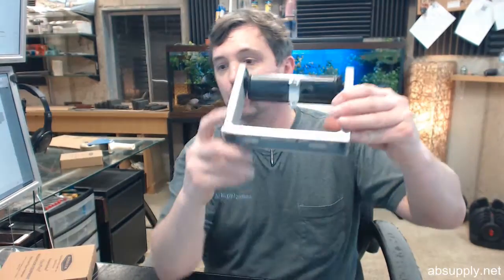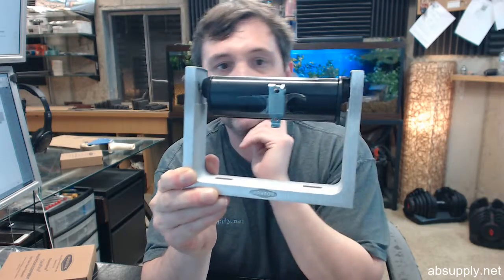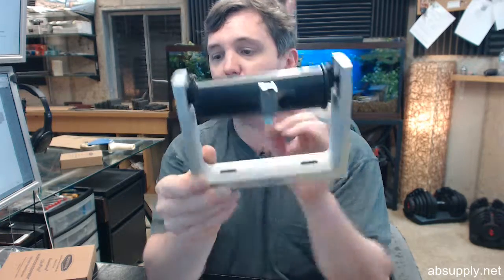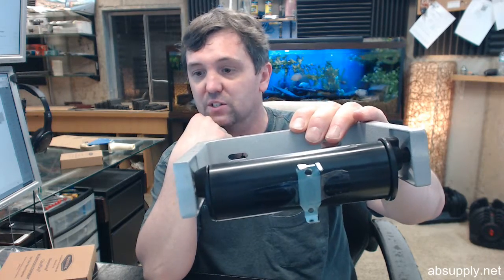Now, importantly, next, dimensional information. Recommended mounting height for universal barrier-free design, ADA compliance, 19 3/4 from the finished floor to the top of the unit. That's important to know. If it's not handicap compliant, you can certainly put it wherever suits your application. Heavy-duty cast aluminum with a satin finish, molded high-impact ABS plastic equipped with retractable pin and concealed locking mechanism with the key. Operation accommodates one standard core toilet tissue roll up to 6-inch. Spindle can be removed with the special key furnished, making it theft resistant.